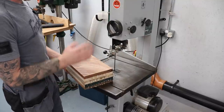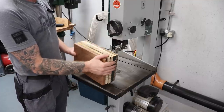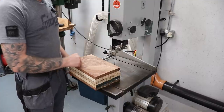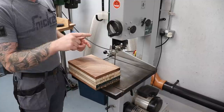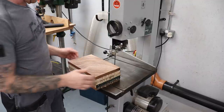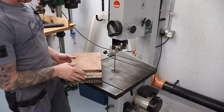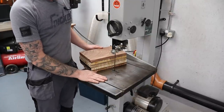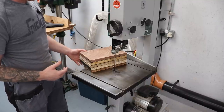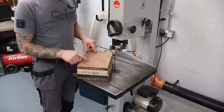Here we are at the bandsaw. The process of cutting makes the bandsaw box: first we cut the outside shape, then stand the box on edge and cut the back off, then cut the internal drawer out. Then we cut the front and back off the drawer, scoop out the center, glue back the front and back, glue the back on the box, and finish everything up. I have a quarter-inch 3TPI blade in — good for cutting tight curves and shapes. Make sure your blade is exactly 90 degrees to the bed and the bandsaw is fully set up. Setup is everything when making bandsaw boxes.